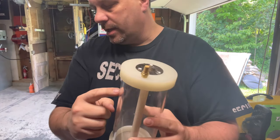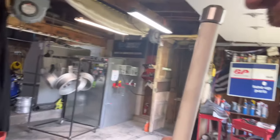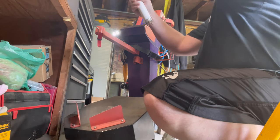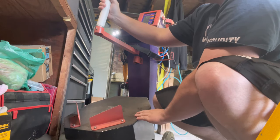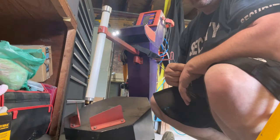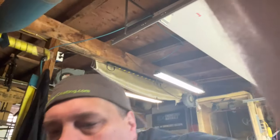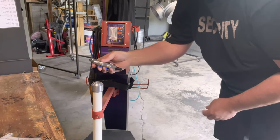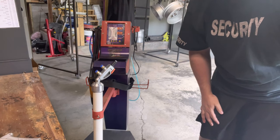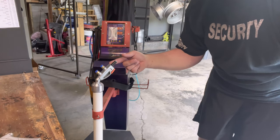Same as the cup — three-quarters max, do not go higher. You need that air space up in there. For the down spout: there's a box that sits here, this tube goes down into the box into your bag, and the tight end holds it there. When the machine is running with all airlines hooked up, this tube will be going to your gun. This part goes into your gun — it has a barb on the end.